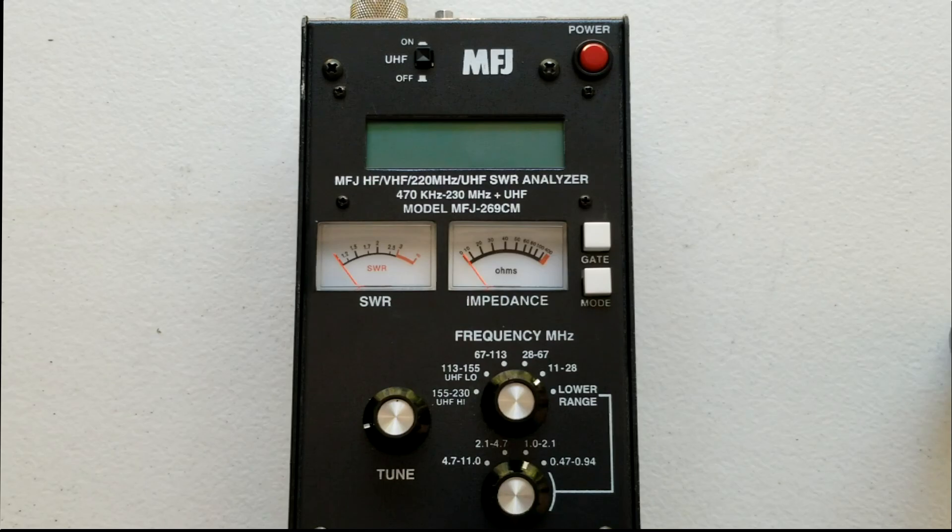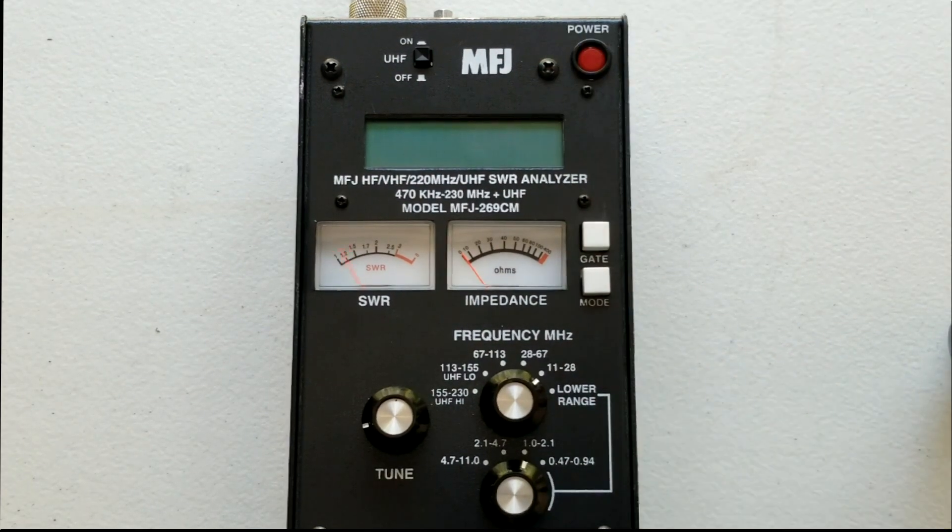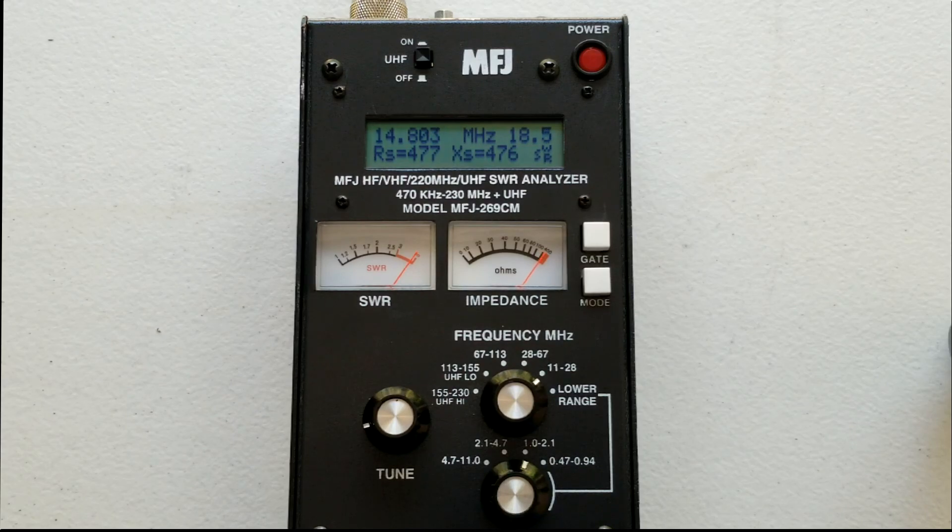Okay, so we're back. I've actually moved into my garage to cut down on the noise from the cicadas this year. Let's turn on the MFJ-269 and let's see how the Octopus on 20 meters is doing. I've tuned a pair of hamsticks previously — you've seen that in our Octopus video. We actually use color-coded tape as well. But notice we're a little bit high in SWR and we're not on frequency either.